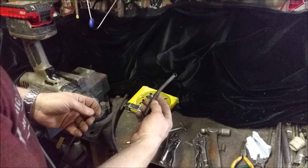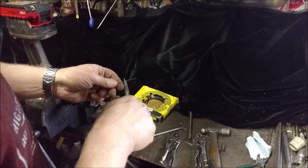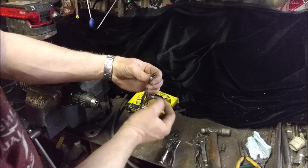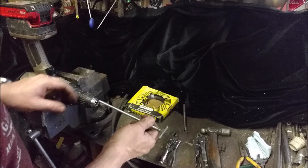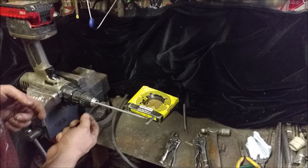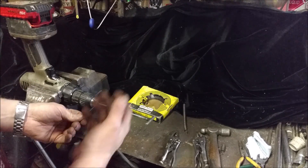To make a spring about this long, it took about 15 feet of wire. Here we've got about a four foot piece. I'll put a 90 degree bend on it. To make different size springs, you'll just use different diameters of rod. I got a good 90 degree bend and I'm going to jam that in — it's just loose, but jammed in far enough that the drill will actually hold it. Now I can begin.